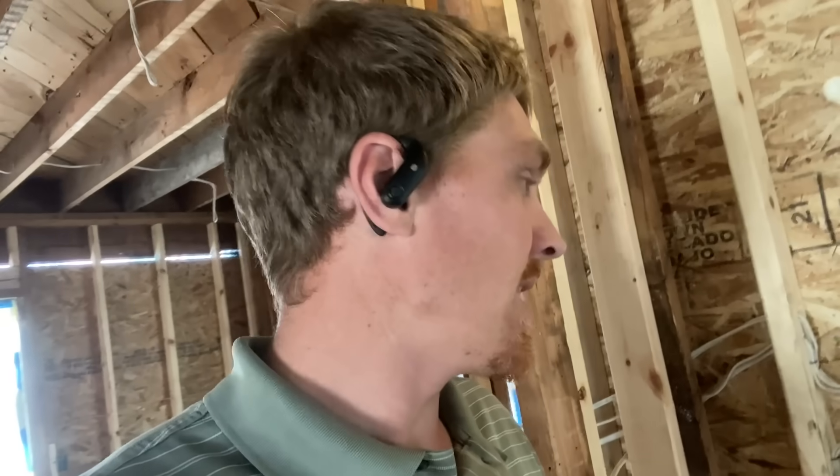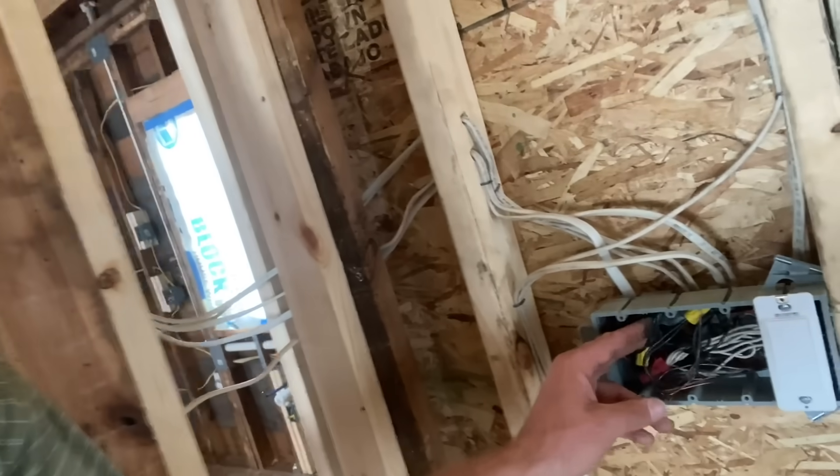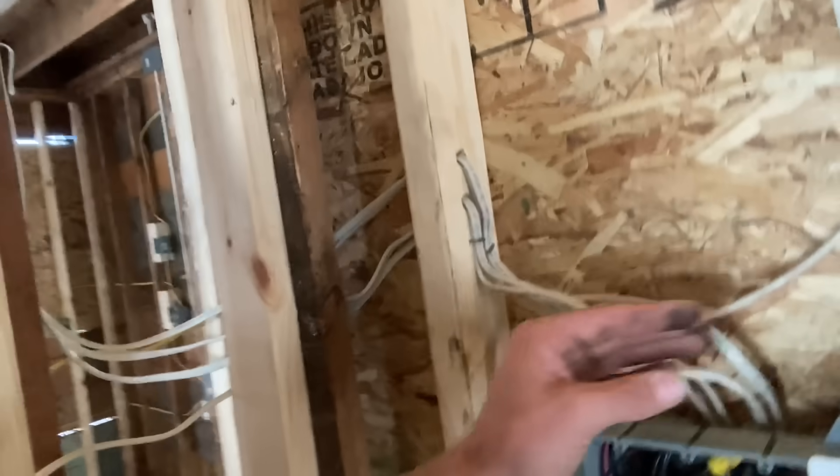In the process of wiring this, I really sweated a lot of the small things — like this box here. Is there too many wires coming into this box? Do I have them anchored correctly? But the inspector really didn't seem to pay a lot of attention to that. Ironically, the one thing he flagged was this fire stop for wires going from the second floor to the third floor, and from the basement to the first floor — just spray foam in the holes where the wires pass through.